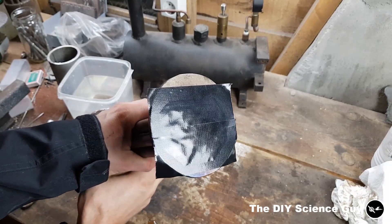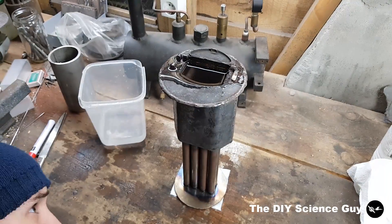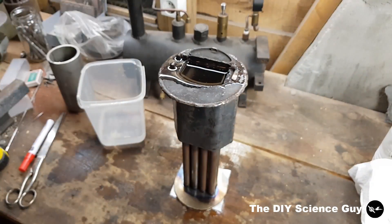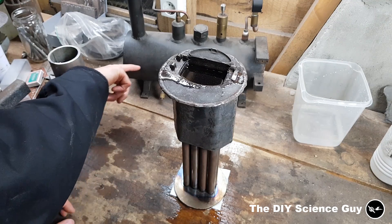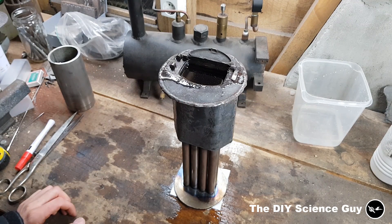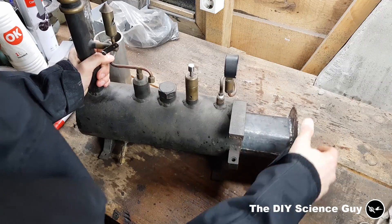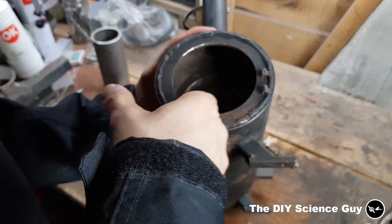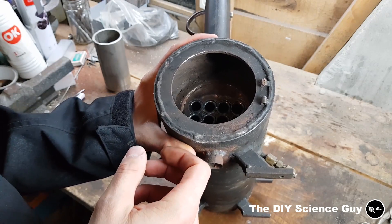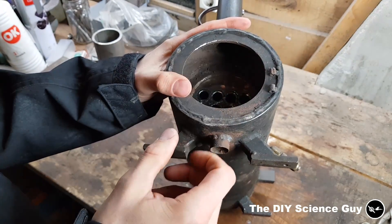So as you can see I taped off the back end. Let's fill her up with water to see if there aren't any leaks. This side is most important because when it's all welded together I can't reach this side. The back side I can always reach through the firebox. It seems okay. So let's remove some stuff that's in the way. This part goes in here like so. Then I have to weld this plate in here, but I can never reach it with my TIG torch and simultaneously add material. So I'm going to grind off this back piece — it doesn't need to hold pressure, so it doesn't matter if I cut it open. That way I can more easily reach the weld.